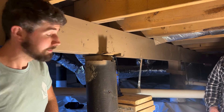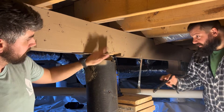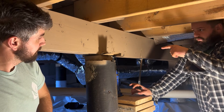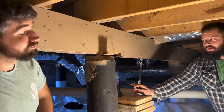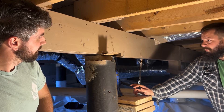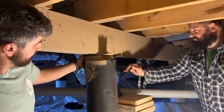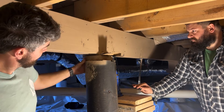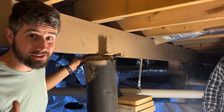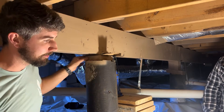And now slowly jack. We just need to take the pressure off of those shims. Something else to look for is some of the shims are nailed and some of them aren't in this house. Most people will have nailed them before, so if you're jacking it up and you're not getting pressure released, it could just be being held on by the nail. Two jacks is all it took to get enough pressure off of this thing, and we got a nail we had to cut through.